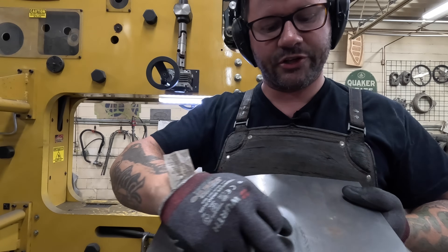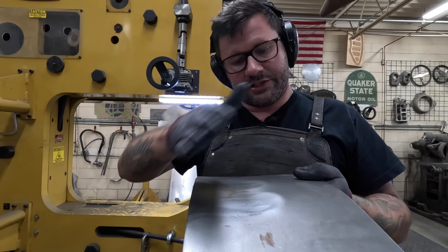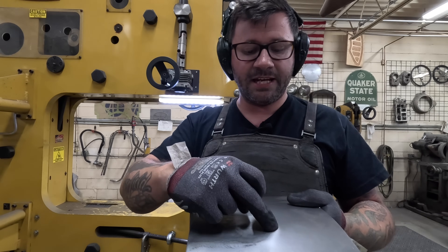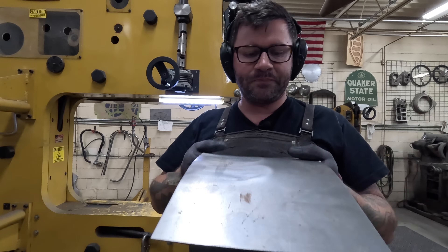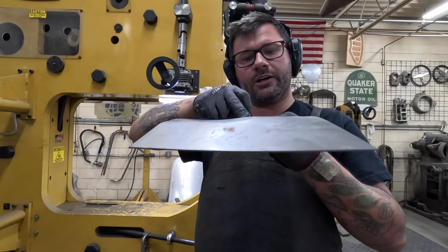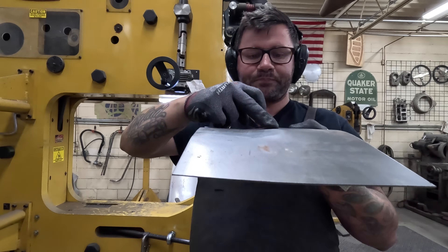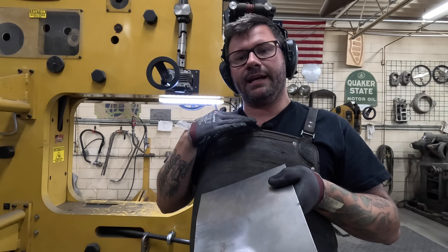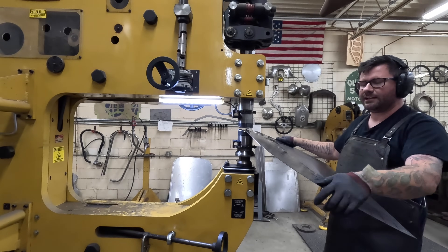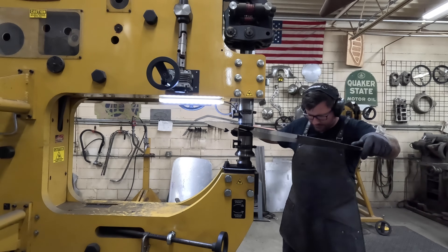You can see the tuck - that's the overall shape and that's how quickly the hammer puts it in. On the way out, it hammers across it, gathers everything in, thickens the metal, and shrinks it. I've applied a little panel lube just where I'm going to be shrinking to help it glide through the dies better and not feel gummy. Here you can see the closed tuck pulling the material down into a compound shape. Just as I described, there's going to be a lot more shrink needed at the edge than closer in. Now let's switch over to the blank for the wheel well and start the initial shaping.